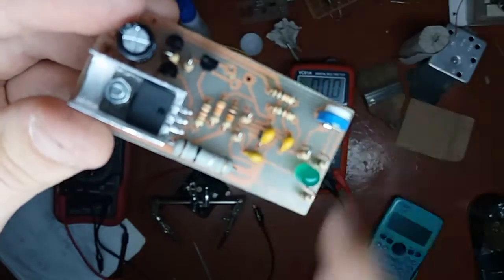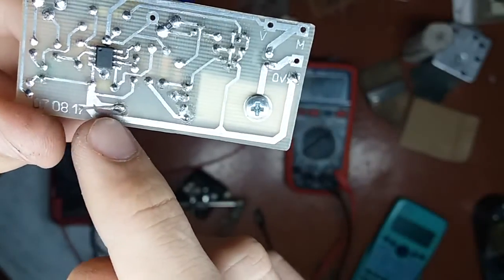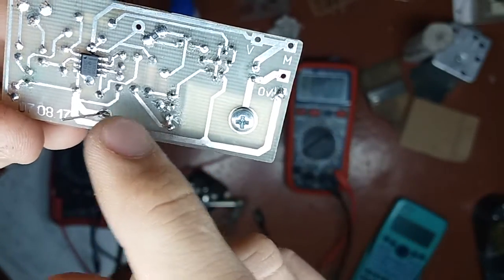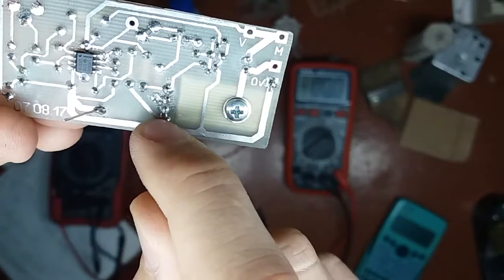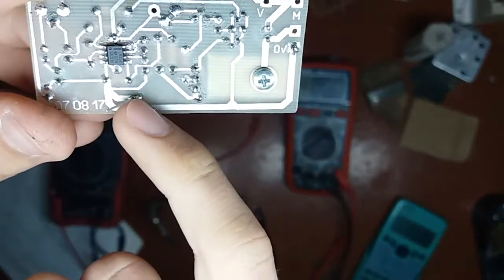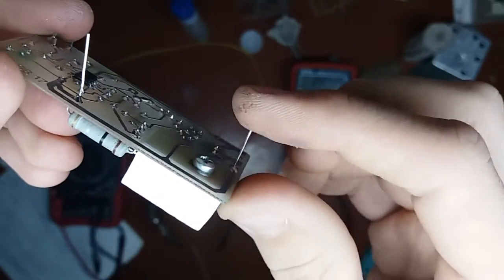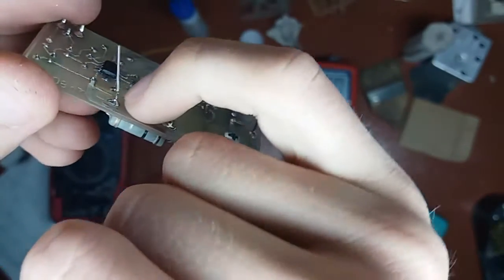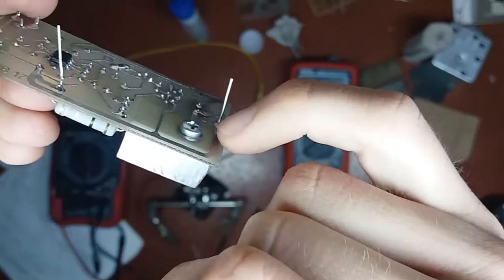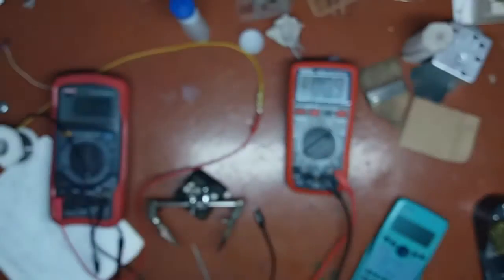You can see the board. There is a resistor, and there is this track which carries current from the source of the MOSFET. Source of the MOSFET is here. There is a resistor here — this shunt. So the current goes from here all the way over here. I soldered a little bit of wire there. I'm gonna hook the power supply close to the joints and take a measurement with a millivoltmeter on the ends of these wires. We'll see what we get.